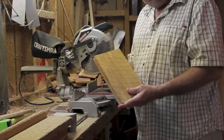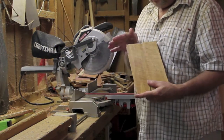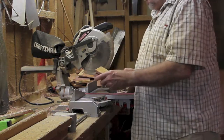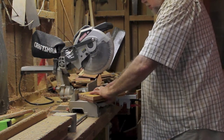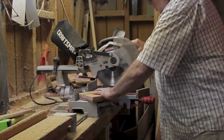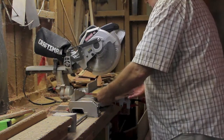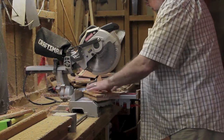I've decided how I'm gonna cut the sides. I'm gonna angle the front of the birdhouse down so the roof overhangs a little bit, and the back roof will be slanted also. So I've got my lines drawn here and I'll use my saw to cut those out now. I'll try to put those boards together so I'll get both cuts at the same time — if I can hold them together and not let them move, that's the tough part.